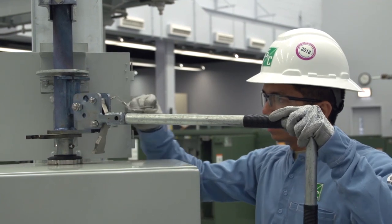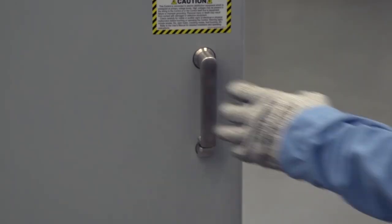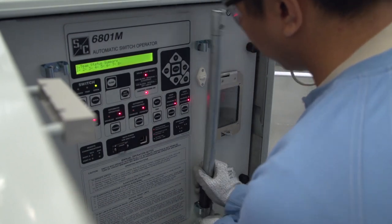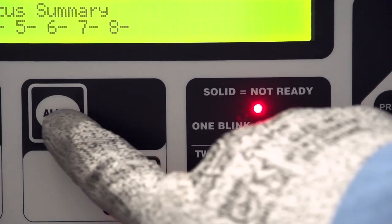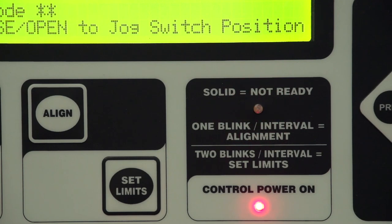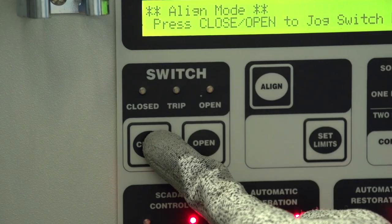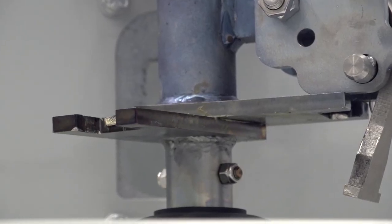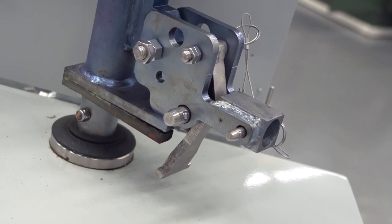Remove the handle and replace the handle pin and the empty handle bracket. The operator should remain decoupled from the switch. Open the enclosure door and store the manual handle on the faceplate. The Not Ready LED will turn off. Press the Align button on the faceplate. The Not Ready LED flashes to indicate the operator is in the Alignment mode. This enables slow operation to jog the operator each time an open or close button is pressed. Use the open and close buttons to jog the operator slot so it aligns with the switch decoupling slot.